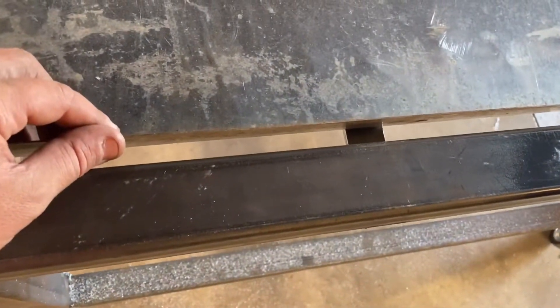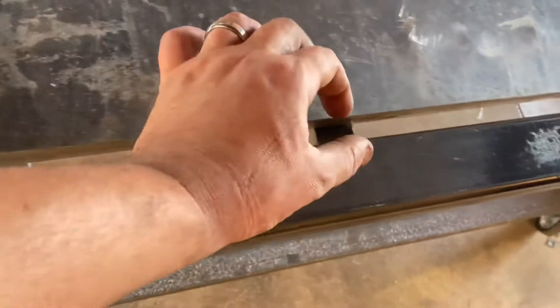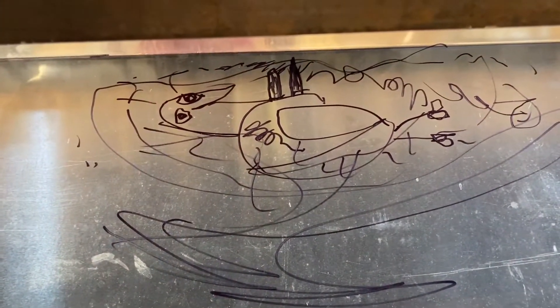This should be sufficient. We made it so there'll be a one-inch gap all the way around the table. I have it sitting in here now so you can see — we'll just cut out a piece of one-inch square tube, cut a couple blocks as spacers, one in each corner, to keep the water table centered where you want it. I'll probably slap some paint on it even though it's aluminum, just to help with corrosion. And there's a very nice drawing of a duck that my four-year-old did — it's a shame to cover it up.